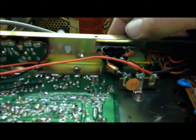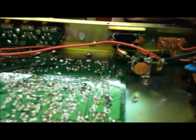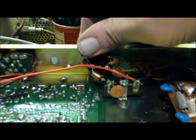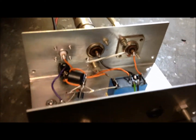Okay, that's all plugged in. I put a radio plug on it. I never understood why they did this, but they put a 12 volt jack right here on the back of the radios - that's if you wanted to run this type of radio in your mobile, which I would never do. So what I did is I converted the jack off the switch so it receives a 12 volt constant, so I can hook up any accessory I ever wanted to the radio, just utilizing a feature already built in. That gives me my 12-13 volts I need for the relay. I also added a ground lug just in case, and everything was built around what I had laying around the shop - probably the only new things are the ferrite bead, one of the jacks, and the BNC connector.